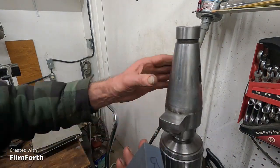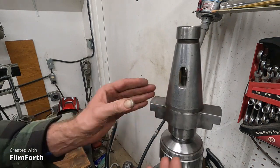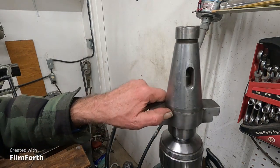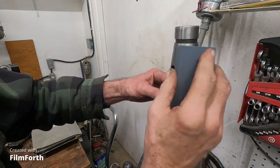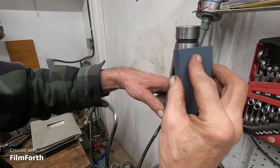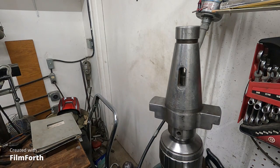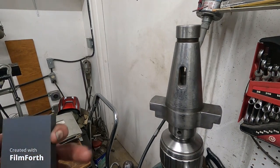You can see it's kind of speckled a little bit but it's got a majority of contact so it should be fine. This is kind of an interesting piece — I could put a center in it and drive dogs with it in the tool and cutter grinder work head, so I think I'll find some good uses for this. I'll test it out and I'm pretty sure I can get this thing to run very true. It's another free thing — well, you have to put a couple hours in it, but it looks good.